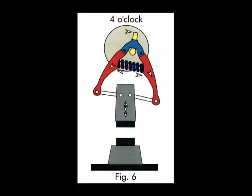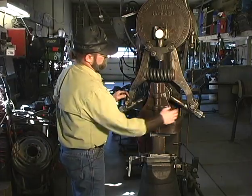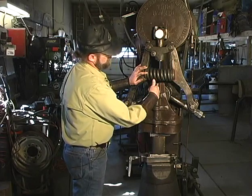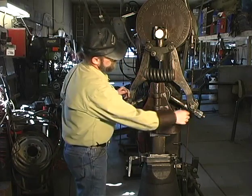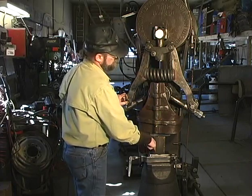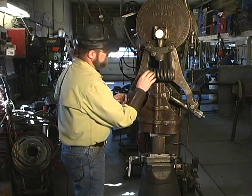By the 4 o'clock position, the ram is past the crank pin, which is already slowing for its stop at 6 o'clock. At 5 o'clock, the hammer should strike your work at its fastest speed, with the ram slightly below center — the links now forming a shallow V, slightly below horizontal. If this happens, the force of the hammer is momentarily held on the hot steel, allowing it to absorb the energy, while the crank pin continues down and passes the 6 o'clock position. I have the hammer blocked up to demonstrate that the spring has enough power to stop the upward motion of the ram with the links angled upwards. So if the links were angled downwards the same distance below horizontal, the spring would also stop the downward travel at that point — any significant deflection below horizontal, you start to lose power in your blow because the spring starts to slow the hammer down.